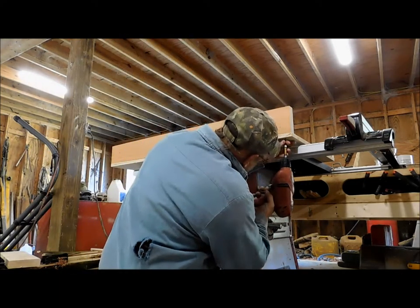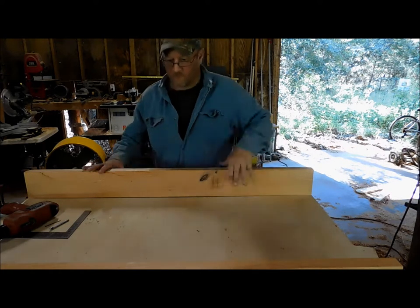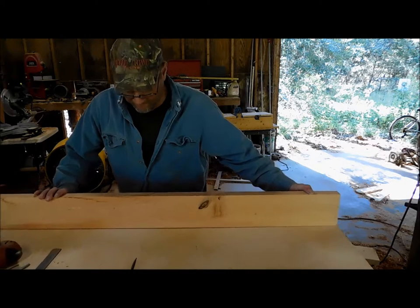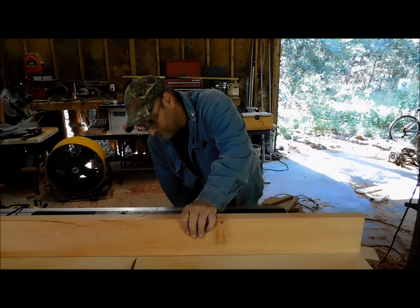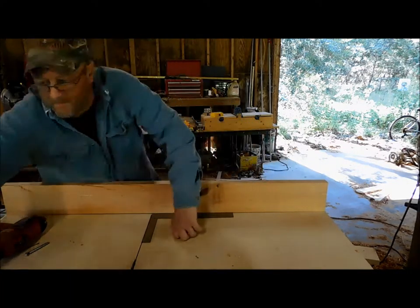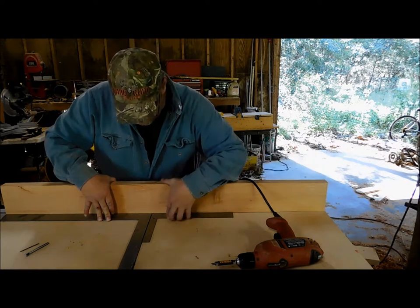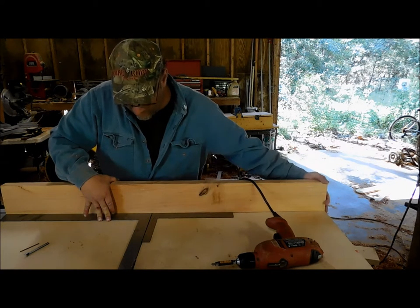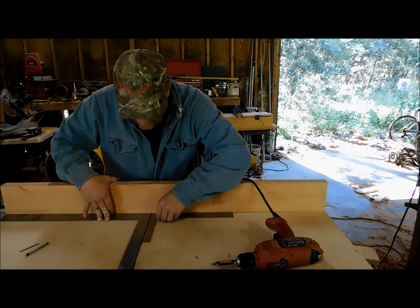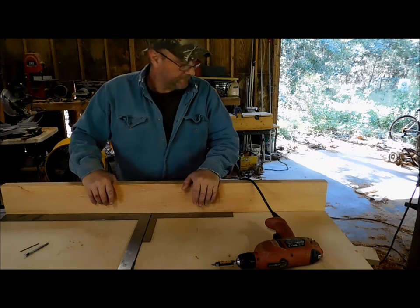That way when we're trying to measure it to make sure it's perfectly square, so when you get your cuts it'll be exactly 90 degrees. I put two squares down to adjust the back rail up and back and see how close I can get to square. I had a temporary screw on one side to allow for that adjustment.